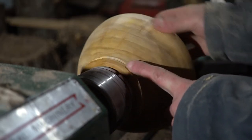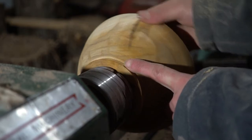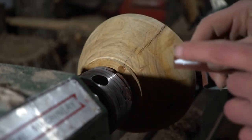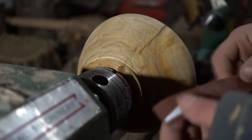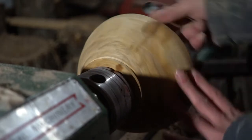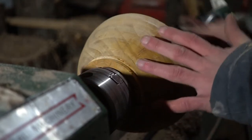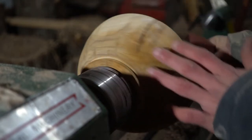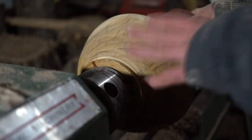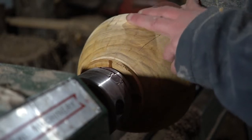So what I'm actually gonna do is hit it up with a bit of 60 grit before I hit it up with my last little piece of 150 grit. You can see a little piece there that attached it to the roll. I have to get more of that on order. But this has a lot of character to this grain. I'm thinking I'm gonna do this one with the boiled linseed oil just to really make that pop, because that oil finish is really gonna differentiate the grains.